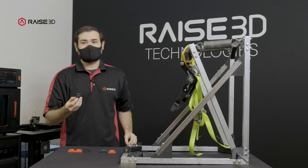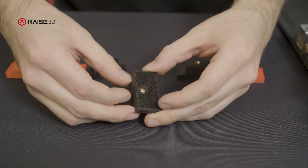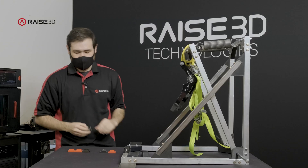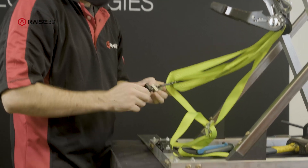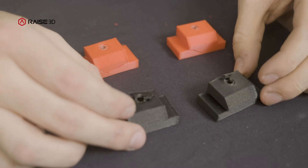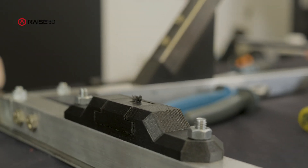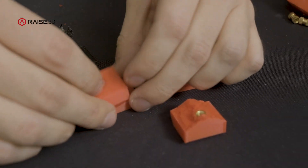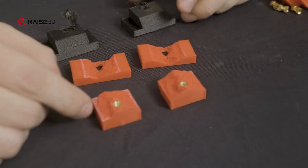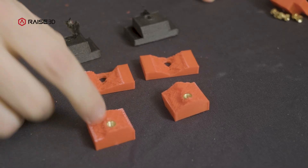For the third type we're running the inserts backwards through the parts so they catch on an upper lip and embed the nut further into the part itself — we expect these to be pretty strong. These got to about 80 pounds and you can still see they ended up slipping out. The PLA ones almost completely separated from the main block while the insert stayed in entirely, getting up to about 100 pounds before breaking. The deeper you set these in, the stronger the insert will be.